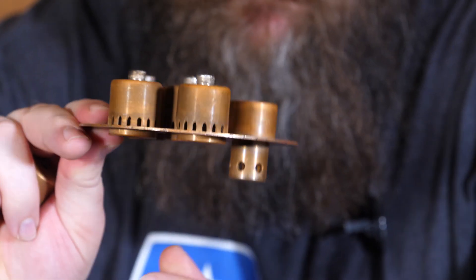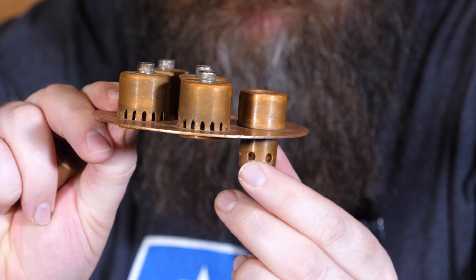Because we have a little cup sitting at the bottom, we're creating a small reservoir for the liquid to sit in. This cup fills up and then as more liquid comes through it starts spilling out through the holes, dripping back down onto the plate below or back into the pot. The fact that this cup is full of liquid is what stops the gas getting back up through the holes. The cylinder is slightly elongated compared to the bubble caps and that establishes the depth of liquid sitting on the plate.